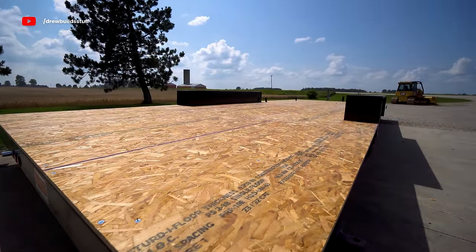With all the sheets installed, we had to install the ridge cap, and I messed up and ordered these sheets a couple inches too short, so we had to get in a way bigger ridge cap to cover that up. But first we had to stick these foam sealer things onto the ribs, and cut away a bit of that underlay so that the roof can vent. Then we put the ridge cap into place and started screwing it into place into each rib.